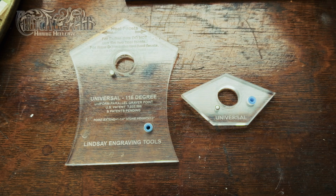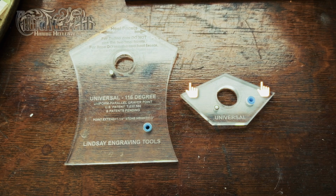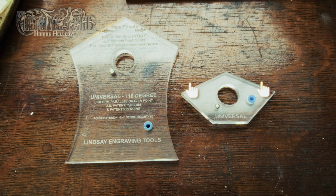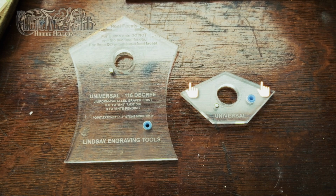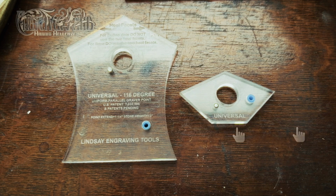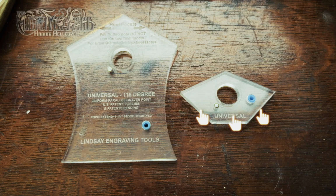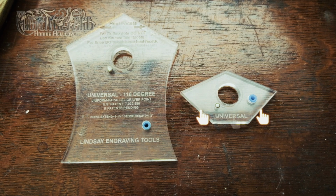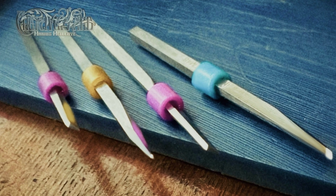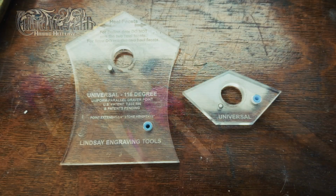Okay, let's go. First, you sharpen the belly. It is very important that you sharpen these two sides equally the same. Then the two upper sides and the top of the graver. These sides are less important, but the more you remove, the tinier the graver will be. It will also be faster and easier to touch up the face later.